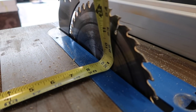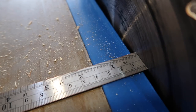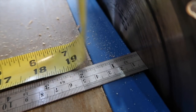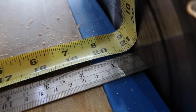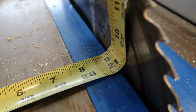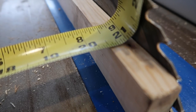So here's another measurement with the same problem, and you could just use a hard ruler. And this one adds an inch. You can tell it's going to be somewhere over 21 here, but it gives you an inch. Just look to your tape measure and you can tell it's actually 21 and an eighth. You could also use a piece of stock wood, 3/4 inch wide. You could figure out a way to put that up against your object that you're measuring to and add 3/4